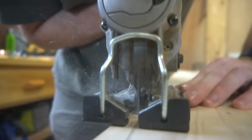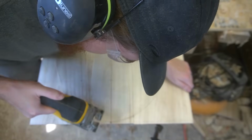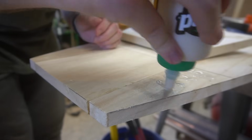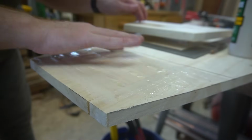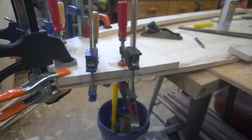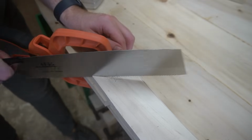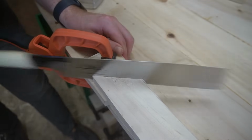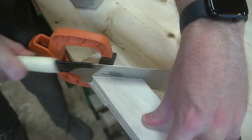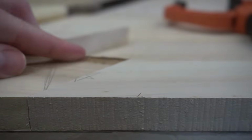The basic idea is that you make a panel for the top and another panel for the bottom. And then you take a couple more layers for the center. They'll be hollow in the middle to create an airspace in between. So what you end up with is a sandwich of 4 to 5 layers with hollow space in the center. One of my biggest challenges for this build was that none of the logs we cut up were actually long enough for this 8'6" long board. So all the rails and all the panels had to be made up of multiple different lengths of wood.